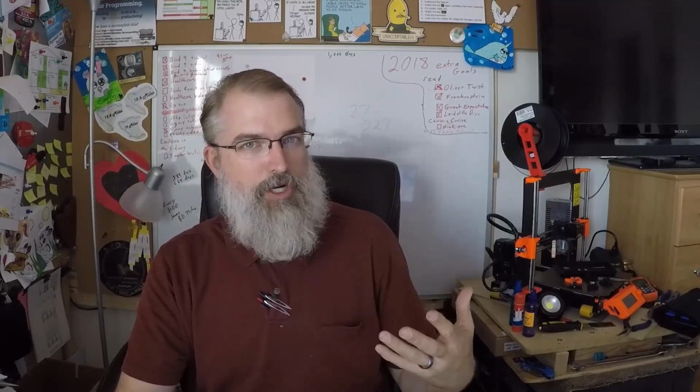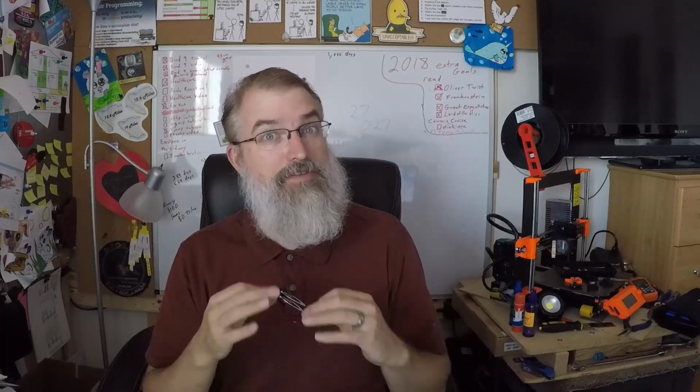You know, just like I was at a conference not too long ago with homeschoolers trying to show them what was going on. I kept telling them, this is not the microwave oven yet. They're trying to get better at this, but if you get some 3D printer and you start to 3D print in your homeschool, you better be able to turn a wrench and fix things. I would suggest that they buy the kit so that as they build it, they familiarize themselves with it and are more comfortable, because it's going to have issues. It's going to break. It's really well made, and I love what Prusa does, but I can't just print on this 24 hours a day, 7 days a week for 10 years and have zero problems.